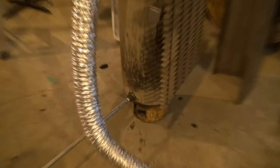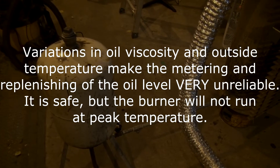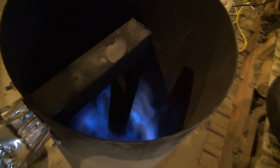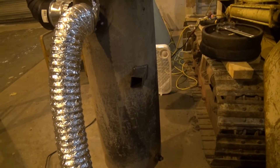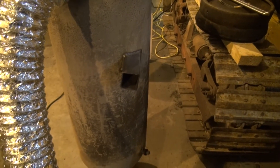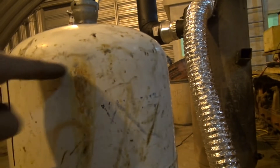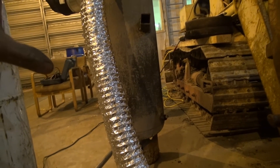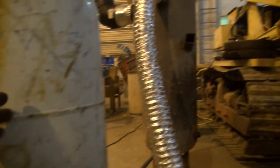The supply pipe is not ideal for that, so I'll have to add a secondary line that does the same thing but does not carry oil. That secondary line will go into the top of the reservoir to maintain the vacuum. In the square tubing there are a bunch of holes I randomly drilled — that's the air supply. There's also a secondary hole for startup and non-forced-air operation, which sits above the reservoir level, so even if the reservoir runs out of oil due to an air leak and fills the burner, the top of the reservoir is still below the bottom of that secondary air intake — so that danger is covered.